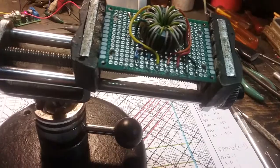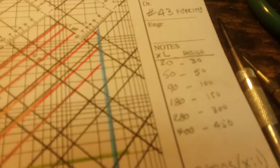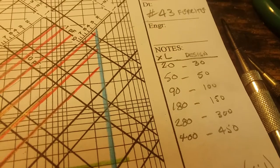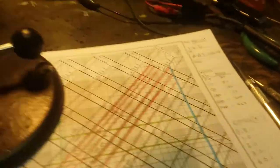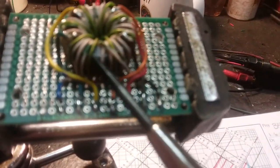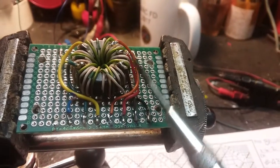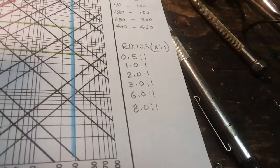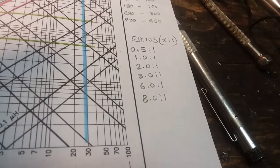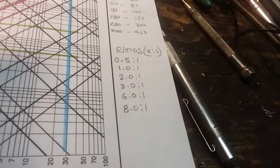The actual impedance numbers — 150 ohm line, 300 ohm line, 450 ohm line. Just go by halves or doubles however you want to do it. Whatever the full winding turns out to be — I'm at about 400 microhenries here — just start cutting it in half and do it in increments all the way around: 400, 200, 100. You're going to be close enough for receive guys. You don't need a perfect 1:1 match — you're not transmitting and worried about losing watts. If it's receive only, just do it this way.